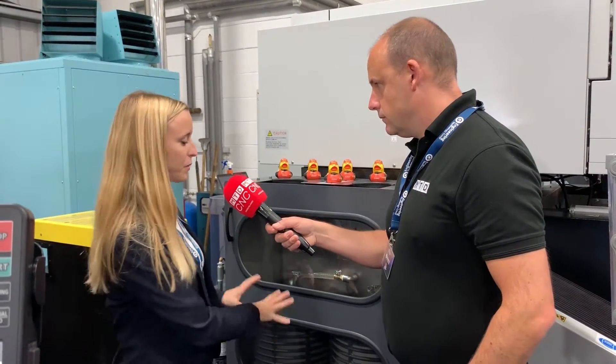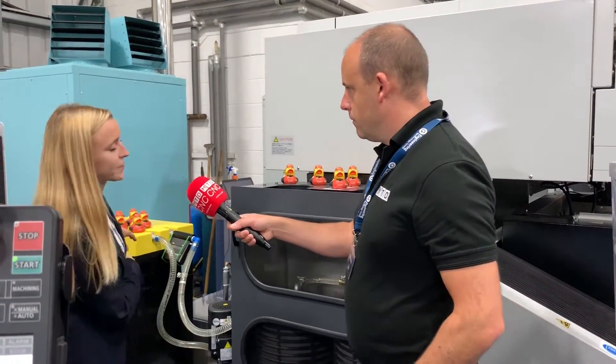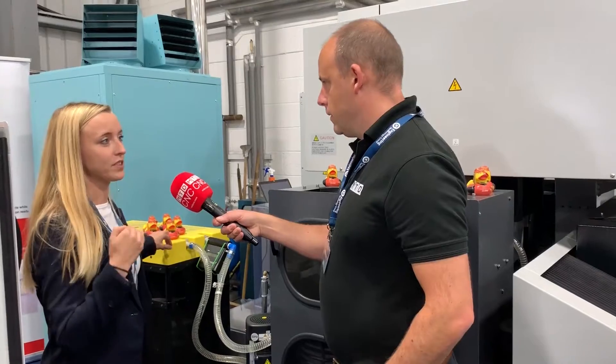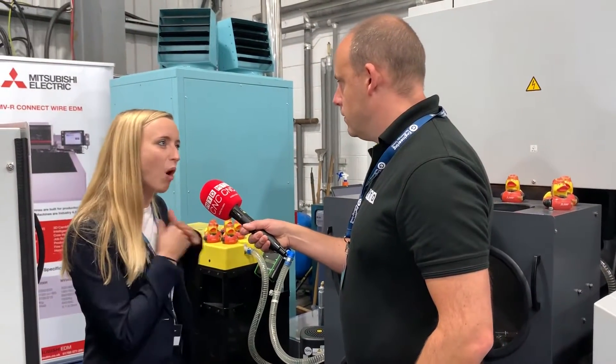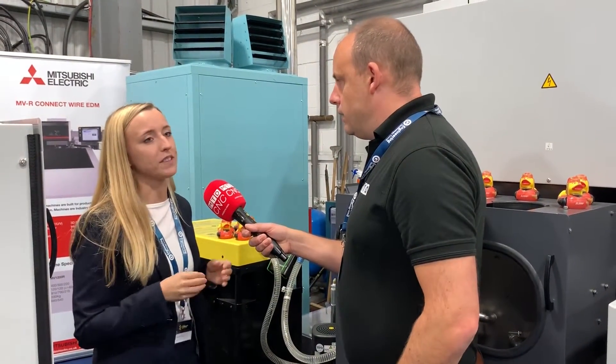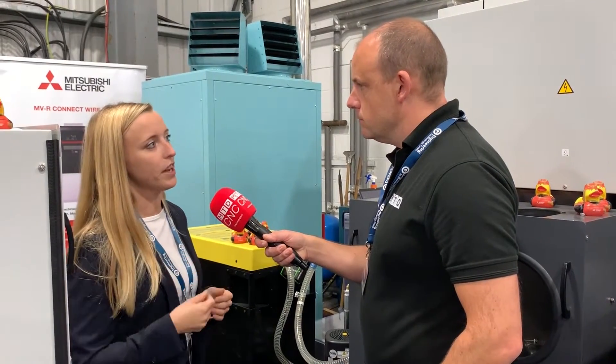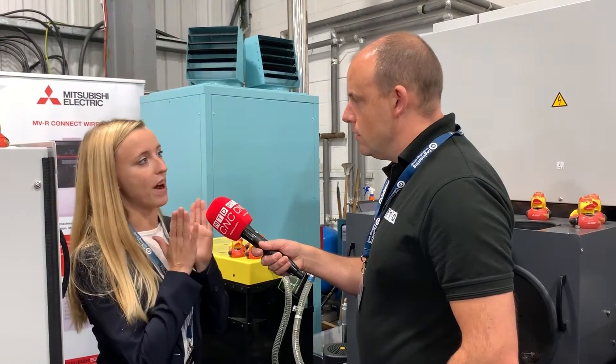First of all you have to take out the sediments in the water — the bigger parts. This is done with mechanical filtration. But the deionization is one step more, to take out the smallest parts in the water. And that's what we have here — this is your product. Correct. Because when you don't have clean water and have a high conductivity, you will always have a short circuit in the machine, because you need only the spark from the workpiece to the wire.